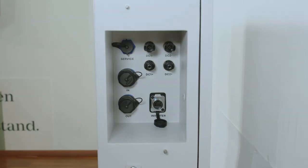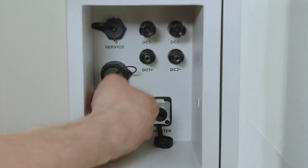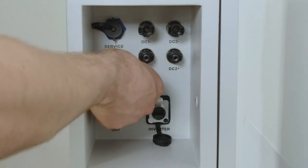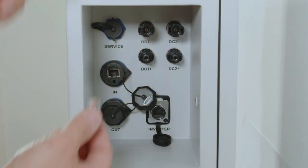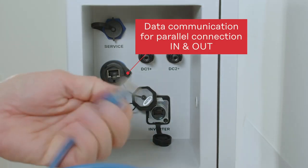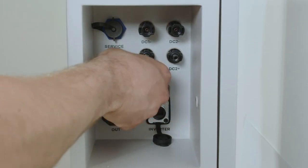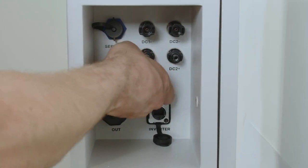For the parallel connection of multiple towers we also need an Ethernet connection between the towers for data communication, and therefore we have in and out plugs with Ethernet sockets. To open these you can remove the cover; beneath that you have an end resistor as an Ethernet socket open in the battery. When installing a parallel connection you use an Ethernet socket to connect the multiple batteries. However, when you are not using a parallel connection, the end resistor needs to be plugged in and the cover of the in and out ports needs to be closed.